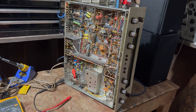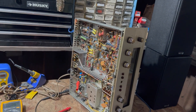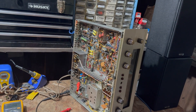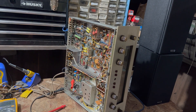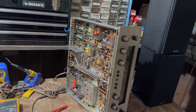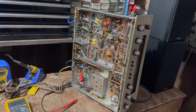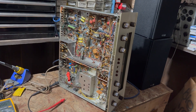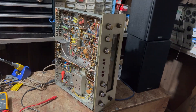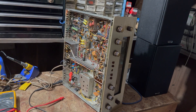Our voltage going to the tubes is minus 25. I'm bringing it up on the Variac. I'm going to put in a CL70 or CL80 — what that does is make sure it gets a slow start. These power switches are known to go bad, and if you put a CL80 or CL70, it helps prolong the life of them. I will say, it does sound nice — maybe we're not totally lost here.